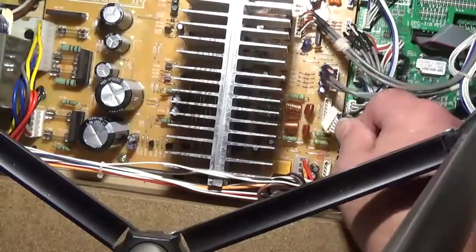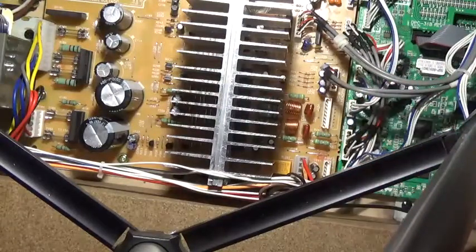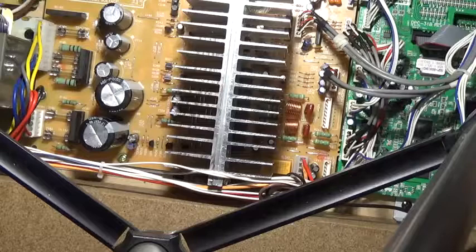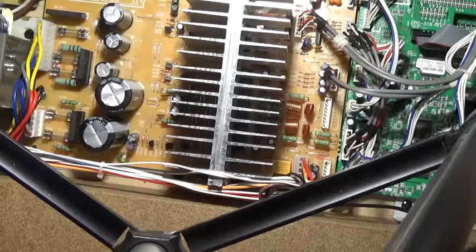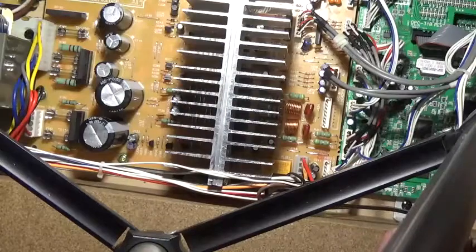And it's not plug compatible because the leads off the wires are ground mute left and right, and on the 7-pin they're ground mute left and right, 5 volt 5 volt. On the 6-pin it's ground left right mute. So we don't feel that there's a good way to alter this pin jack or put a 7-pin in.